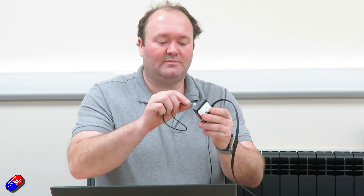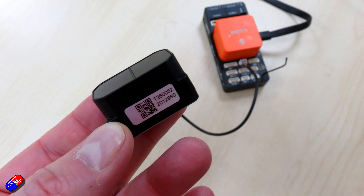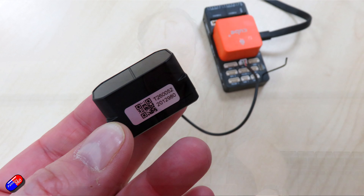We're going to plug the lidar into the spare I2C port on the Cube Orange, labeled I2C2. We've made that connection with the sensor pointing downward. Note that these are LED lasers — some lidar units are very high power — so definitely don't look directly at them. Let's give it a moment to boot up.